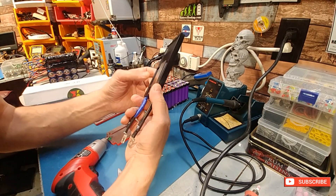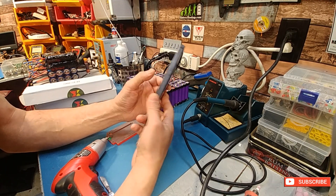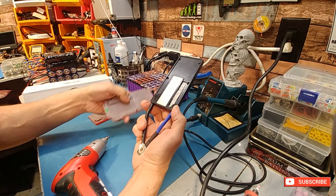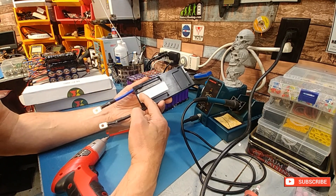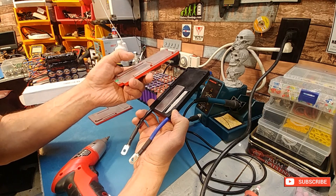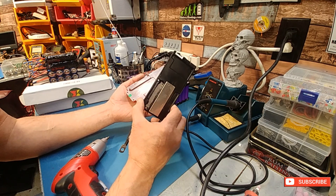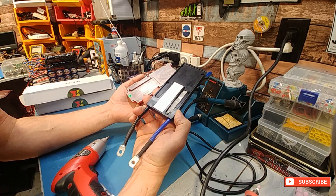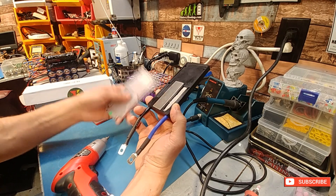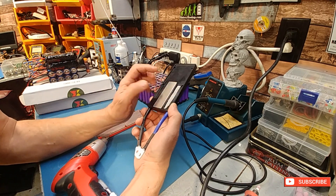Okay, there is actually something worth noting here. These are the balance resistors here, and obviously they're using that goop and heatsinking to the surface there. This part here is your FETs, and there is no grease or anything on them — they're just relying on heat transferring from the FETs to the surface, which it will not. If you load this at 100 amps, which it's designed for, you're going to have premature failure. So you're going to want to put a layer of thermal grease on that before you slap it back together.